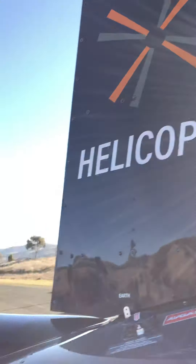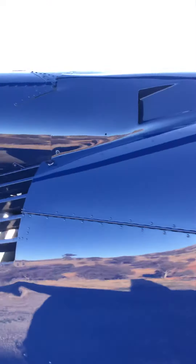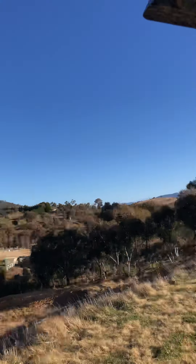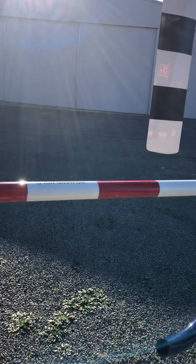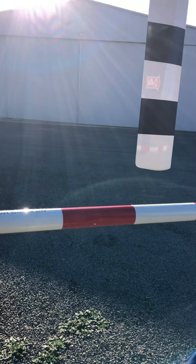Let's go over the rest of the helicopter, checking that everything's looking good. Check all the rivets — you run your hand over it, visual inspection, just to make sure it's all looking fine. This is the candy cane here, checking all the surfaces that nothing's been hit. As you're touching it, you're looking for anything that's wrong. There's the bump stop at the back — if that's hit the ground, you'd feel the paint potentially chipped.